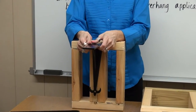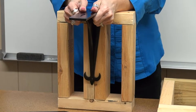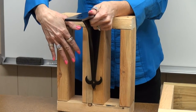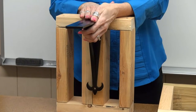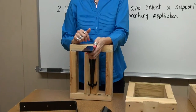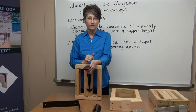You may need to do it from inside the cabinet if your fascia is already up, or you can remove it to install the blocking where you're going to place your brackets. Then you'll put your fascia back up, because these are installed on the finished front of your countertop base. You'll want to check for level in this plane, and as you put up each successive bracket you'll want to check for level in this plane as well. At this point, add a bead of silicone on the top flange, set your countertop, and enjoy your new kitchen.